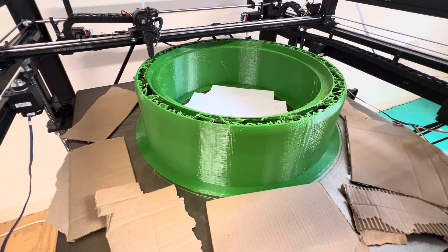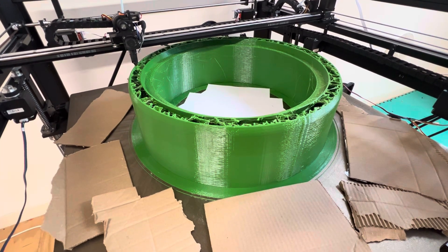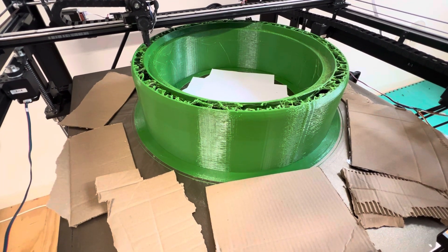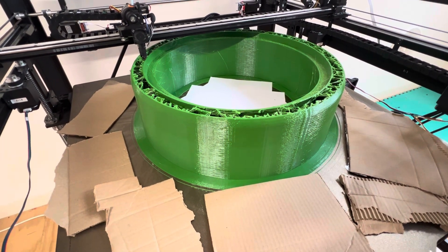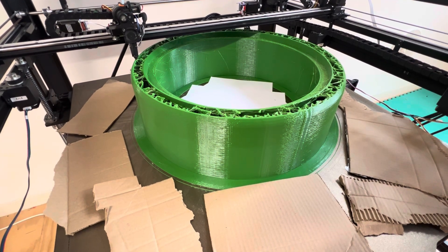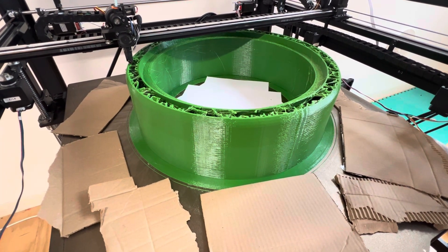This is a 1.4 millimeter nozzle and I'm running PETG, which is notoriously tacky and stringy. I had to put a permanently joined brim of 25 millimeters around the outside, which I'll cut off with a knife, just to make sure the hold-down is good. I threw down some glue stick as well, but the 1.4 millimeter nozzle width with two walls using PETG is spectacularly tough and durable for making display parts that people are handling out in public.